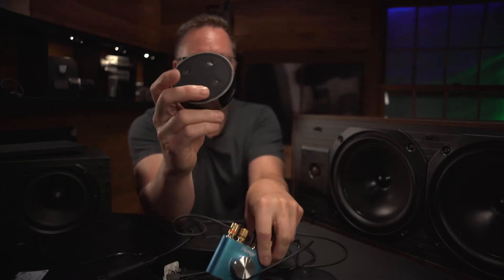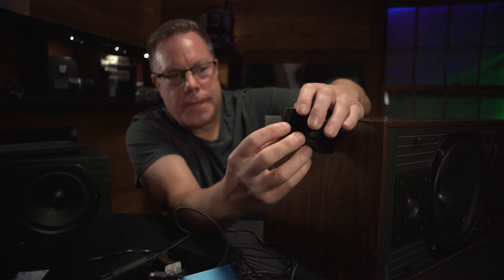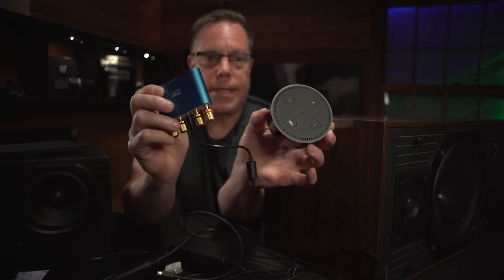That was why I decided I was going to get this style amp, and I have three of these coming. For now, because I don't have them yet, I was thinking maybe we pull off one of these speakers and see how much room we have inside. I don't need a volume switch with this one because the volume switch is on the top. So what if I just took this and mounted it to the top of the speaker — not on the outside, but drill a hole right here that's perfectly the same size as this? This would drop in so you can still see this little ring as it lights up. We could still get in there and carve it out. No matter what it's going to work, but we just need to be able to get to these plugs. We need power, we want sound output from this going into here, and so we're going to do an output to the amplifier, which is going to give tons of power to pump these speakers.